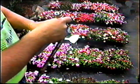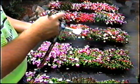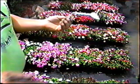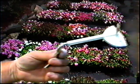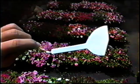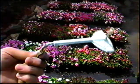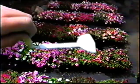Okay, you can see there's a lot of little pinholes that need to be filled in here. This is where Brodak primer really works well. Take a look at this up close. What happens now is I'll give this 10-15 minutes to dry while I'm loading up the truck, and then I'll spray a second coat on. So this will be drying while we're up the field flying.